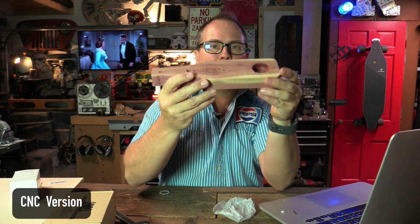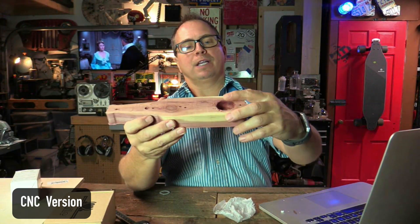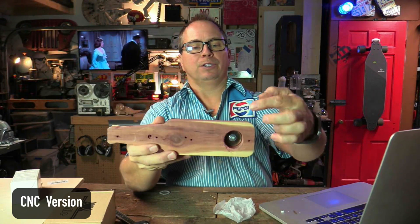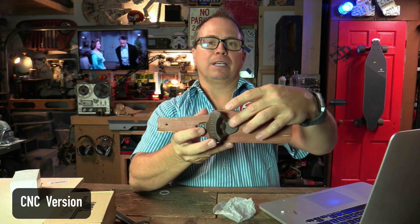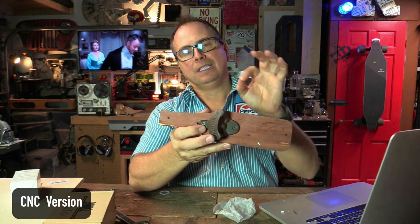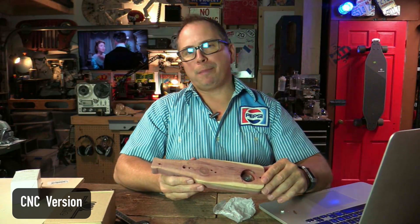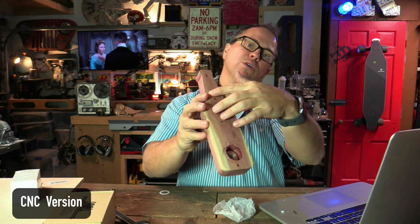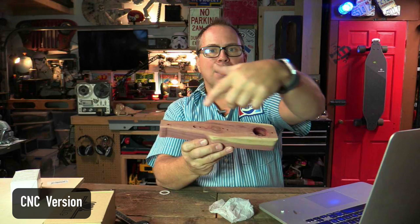Since this is going to be cut on the backside, you're going to laser cut multiple layers. One of the layers doesn't have the hole all the way through — the top layer. You have the bottom layer, the middle layer, and the top layer. You'll add the screws later. For the laser cutter I put little tiny pilot holes, but for the CNC, since I used a quarter inch bit, I gave an indication of where the hole goes but only set it down a quarter of an inch. That lets me recess the screw or guide the drill through the backside. Everything for the CNC is cut from the back — the hole is done, the last thing cut out is the shape.